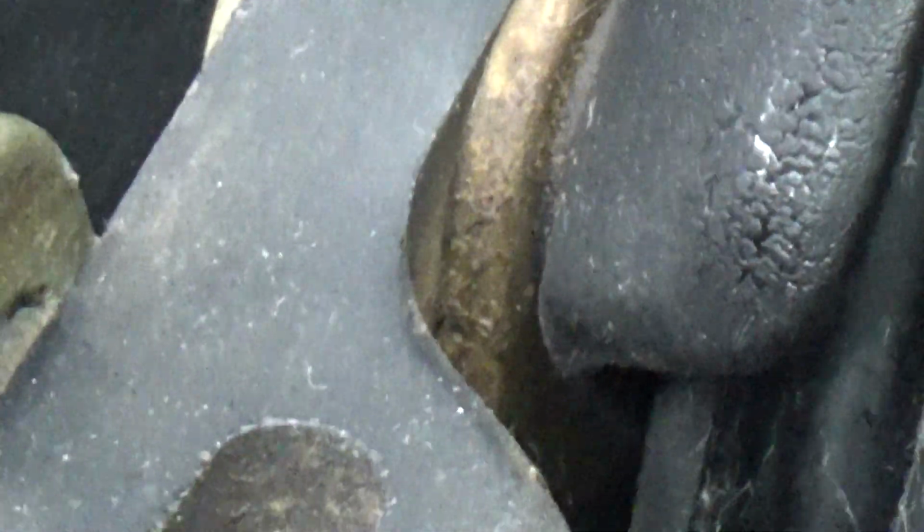All the way around that balance wheel, and some of that looks like it might be pitted, so that's going to take a fair amount more work to get through all of that. And even there, that bobbin winding assembly is going to have to come off the machine. We've got rust in there that looks like it's getting pretty deep. And we've got some paint issues obviously as well. I don't know how much time I'm going to spend on the paint, but there's separation of the layers of the paint, which usually requires some touch up and some new clear coat to protect it and to stop the degradation of that paint, which has already started.